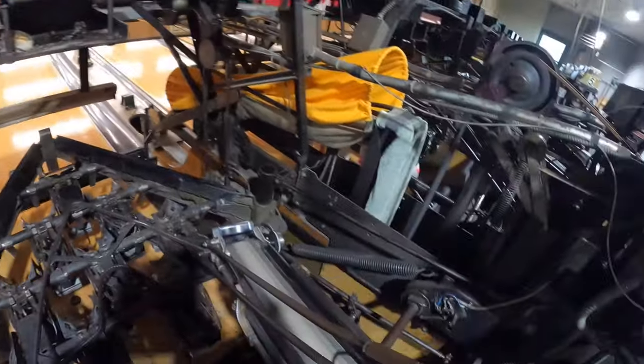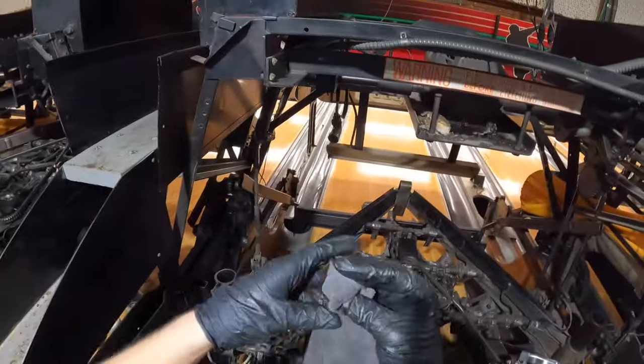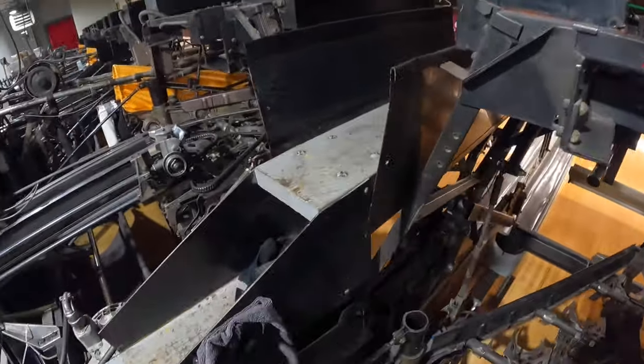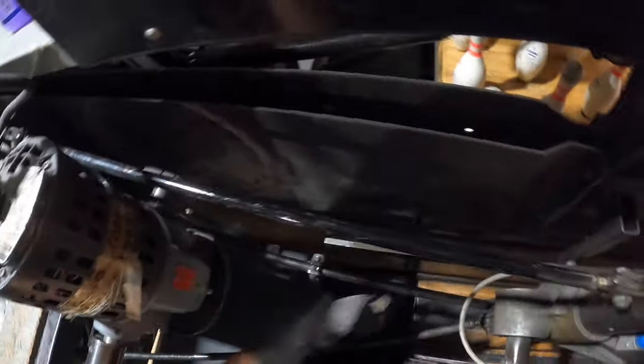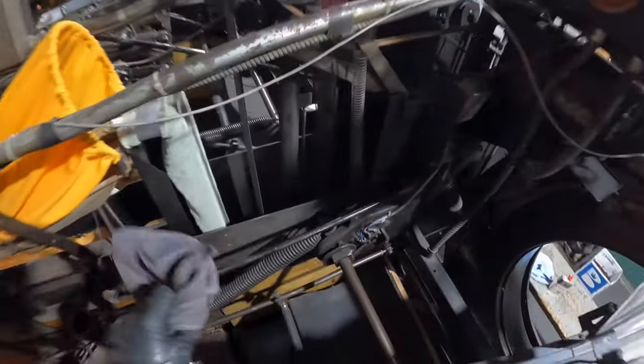I'll just go around and clean my surroundings. The cleaner the better. Now, for example, the rods — the lower table rods. We just got to remember to grease all these when we get done. Do the ones over here. We do have the vertical ball lifts still — we're doing the best we can with them. Because in order to get PBLs in here — those are the ball lifts that go on the 8270s — we have to remove the frame on this side and put the 70s frames in, and that's pretty much taking this whole machine apart. So that's not as fun of a job as many people think.